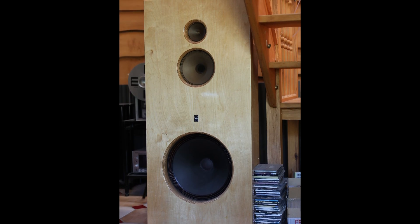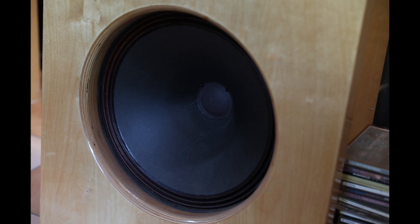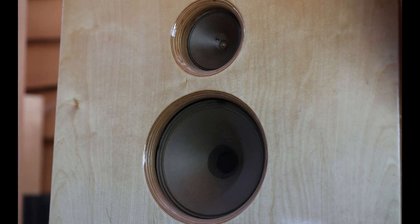So I started with open-back designs, beginning as low as single, two-driver, three-driver builds. As I had a little more money, I moved into a three-way with a 15-inch Alnico magnet-based woofer. I very quickly started to realize that it is very difficult to make two drivers work well when each specializes in a different frequency range. Much easier was to work with full-range drivers, because a full-range driver already offers a much wider frequency range — the most important part of the audible spectrum. It was just a question of how to get the upper and lower octaves.